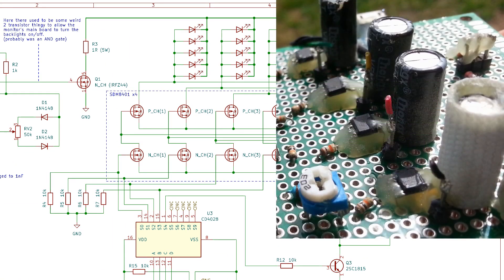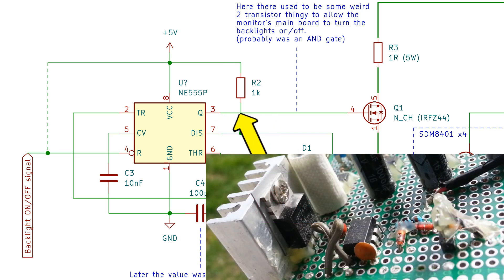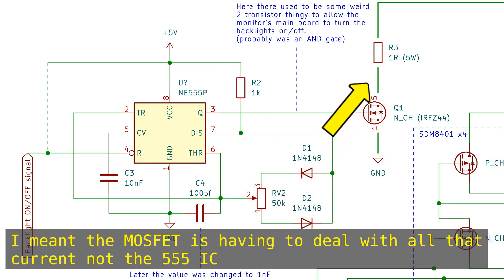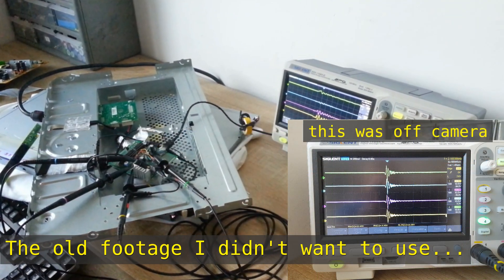Now the final part of the schematic, which I'm going to hate myself for sharing. The outputs of the BCD chip go straight to n-channel MOSFETs used as NOT gates or inverters. The inverted signals then go to p-channel MOSFETs that re-invert the signal again, producing a PWM-like voltage. The output of the p-channel MOSFETs' drain is smoothed out by huge 1000 microfarad capacitors that pull a lot of current to charge up. Then the PWM generated by yet another 555 timer switches a lot of current through a MOSFET, through a resistor that acts as an inductor in disguise, generating a higher voltage — and the caps can't handle that. I give up. Schematics are in the description.